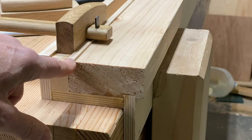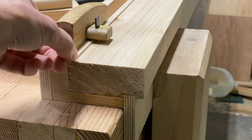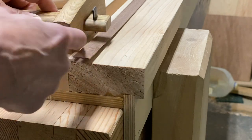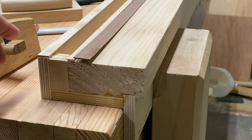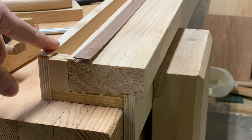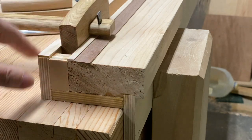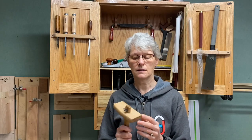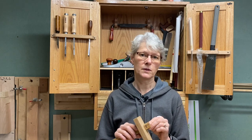I have a small ledger piece here that is about a quarter-inch wide strip — I have something to back it up against. It's not just relying on this fence; I can hold it tight against this strip of wood. The opposite side has another piece of the same thickness of wood glued down on the surface so that my beam rests on both pieces equally. For the marking gauge itself I use not a pin type but one with a blade that actually slices the fibers.